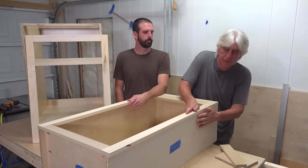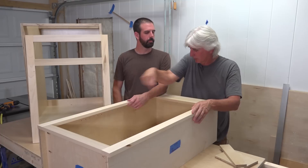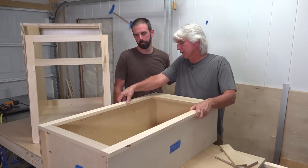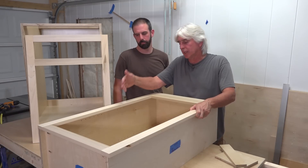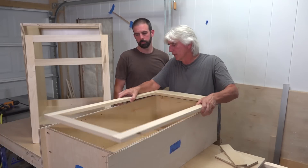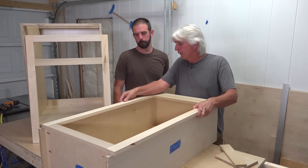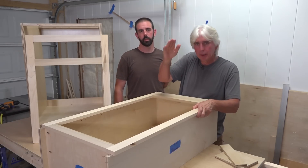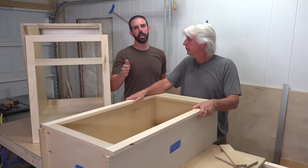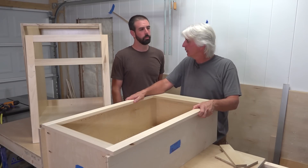You want a little overhang. Even if you saw the edge of this, you're going to see this side just a little bit. So we're going to leave about a sixteenth of an inch reveal there — it helps hide this edge as we've said in a previous video. If you try to line this edge up with the side of this panel, there might be a little bit of wonkiness and it might not look as pretty. If you leave a little bit of an overhang, it hides any deviation unless you really get close and look. Sheet goods are not perfectly flat — there's going to be some deviation, and with it lined up exactly at the edge you're going to see that little bit of deviation. It's going to look horrible.